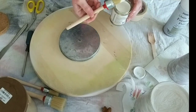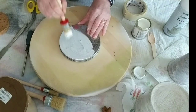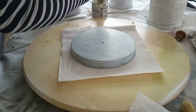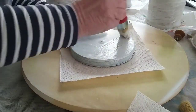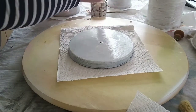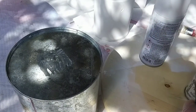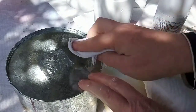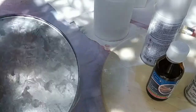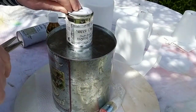A little bit of paint — let's see how it works on metal. It seems to be working okay — I'm pleasantly surprised! I'd always thought chalk paint was some kind of miracle paint that didn't need any prep and would cover in one coat, but that's not the case. Here I am the following morning adding my second coat to the lid. The label soaked off quickly, but I'm left with a sticky residue, so I'm using a little bit of surgical spirit — or you could use white spirit — to remove that gunkiness and get a nice clean flat surface ready for paint.